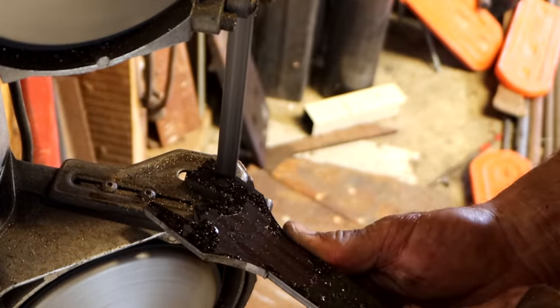So this is the side that wasn't spinning as fast, and I guess I'm hoping that I'm gonna find that this oil looks bad, or maybe it's low, but that doesn't really make sense to me. It's gears. Why would it not spin as fast? Now the end of this isn't even really wet, so it does make me think that the oil might have been low.